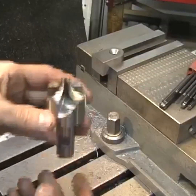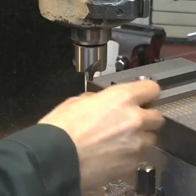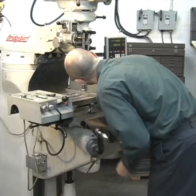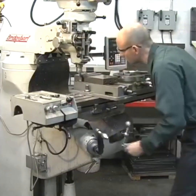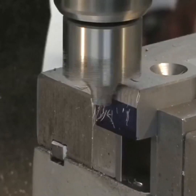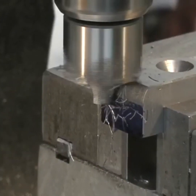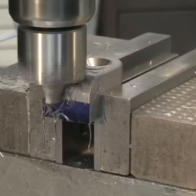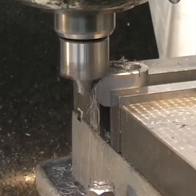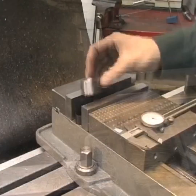This is a different tool we're going to use to do the end of the knuckle. We could use the rotary table like before, but let's try something different — it's a quarter-rounding or edge-rounding tool, and I'm going to use that in the spindle. This is a clunky tool that requires pretty low spindle speeds and very light cuts. A little layout dye on the end of the part helps to visually see what's happening. We make several very light cuts, then flip the part over, and before you know it we've got a beautiful nose radius on this part.